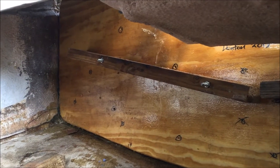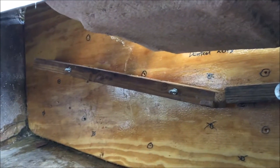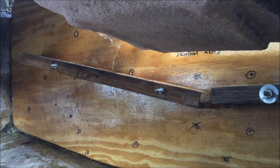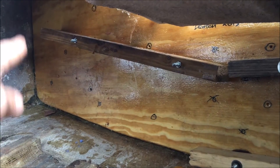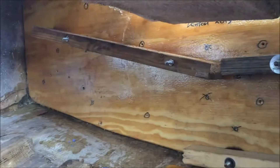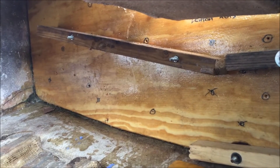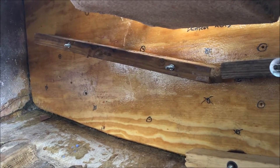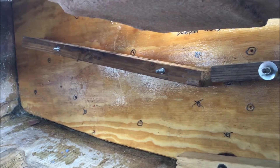Just a quick view from the inside of the transom. I decided to leave the clamps on until I get some more thickened resin shoved up in the cracks. I'm going to shove it all the way around, create a nice fillet - a nice radius for the glass to lay down. So I'm going to do that first and let that kick off, and then I'll pull the clamps off. I'm going to get some peanut butter mixed up.